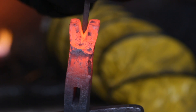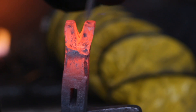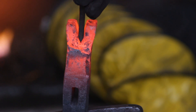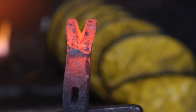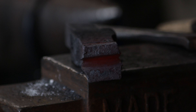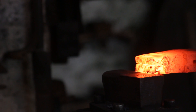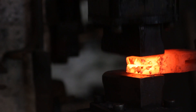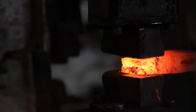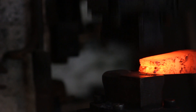It's quite chunky, but I've started doing it this way because I actually find it easier to cut the v-groove in at this stage than after I've tapered the axe head. Here it is with the v-groove. What I will do next is go under the power hammer and start tapering everything. As long as you're careful you should get an even taper on each side of that groove — it just makes the whole process easier and quicker than tapering it first and then trying to split it when it's so thin it's bending away from you all the time.